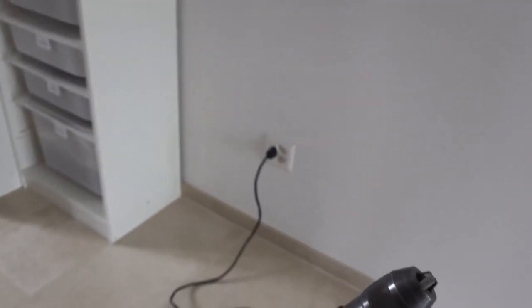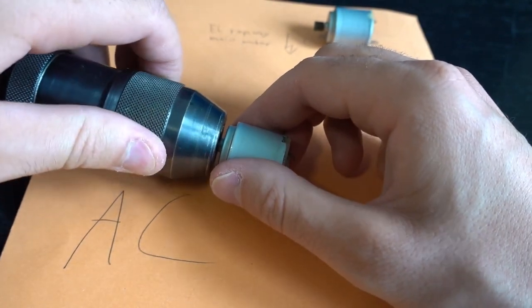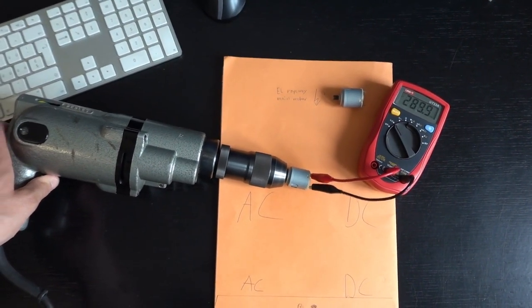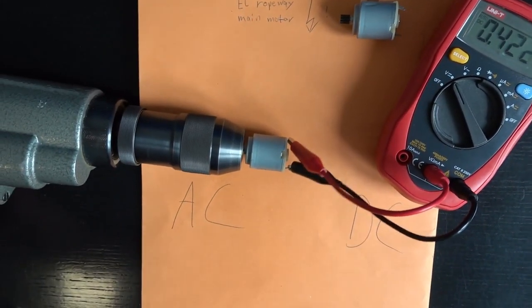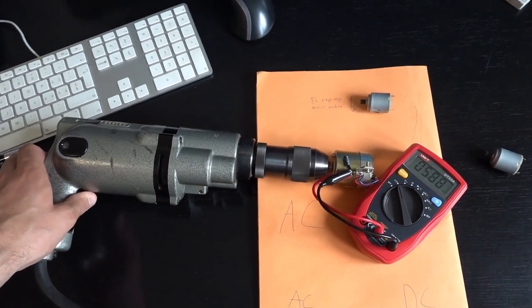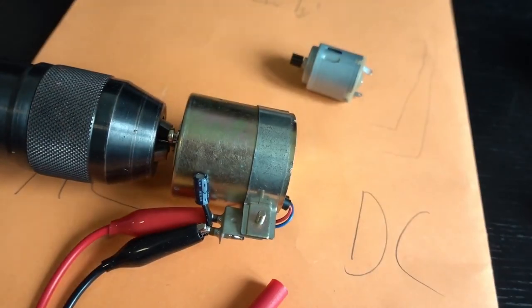This ancient drill is a simple on-off AC motor. Maybe you still remember from school that an electrical motor is also a generator. So let's add a second DC motor and have the drill power it. When the drill spins it, the motor generates electricity. The energy losses are incredibly high and the output voltage is ridiculous. So let's use a larger motor and see if we can get a voltage level that's high enough to make this demonstration work. Seven volts — that should be plenty.